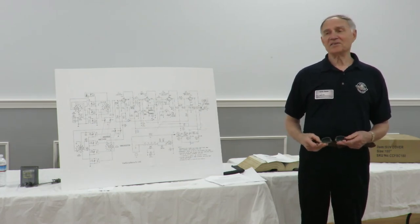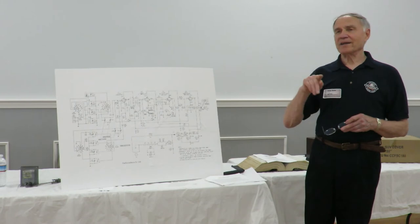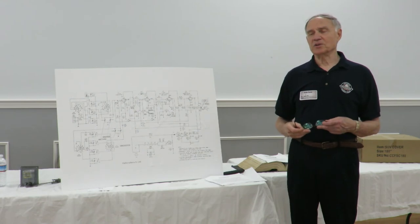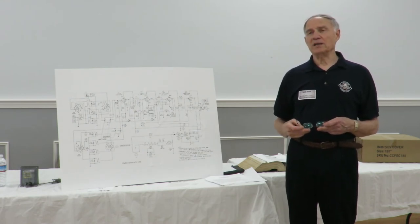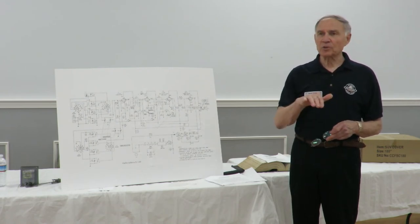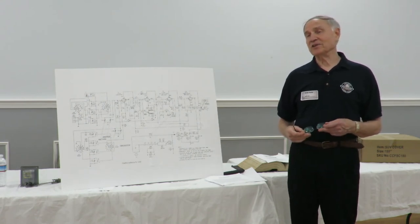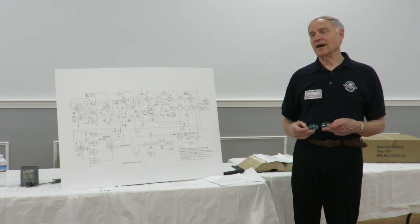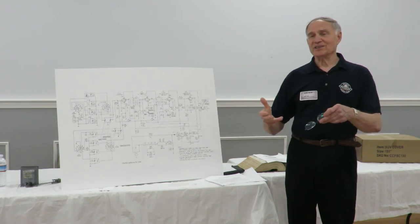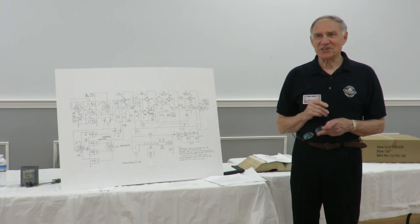Yeah, there are a number of different approaches to take, and this ties back into the visual observation of the radio too. I had one situation where somebody decided to put some spray in the capacitors, and I looked in there and said, what is that? Some of the fluid was still in there, so I had to blow all that out with compressed air. So a visual observation can maybe tell you something about that. Like Larry said, it's hard to talk about these things without getting in there, because what you describe doesn't necessarily enter into my head what you're thinking. And I've seen that happen.